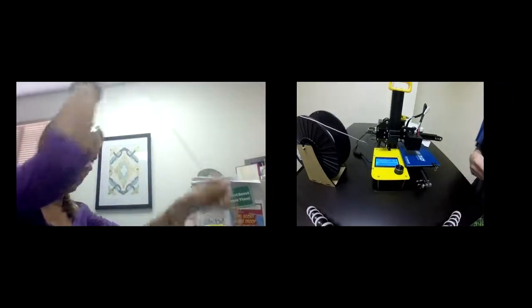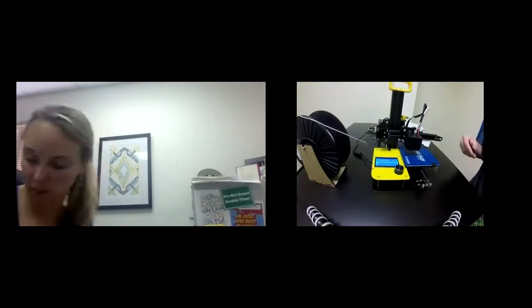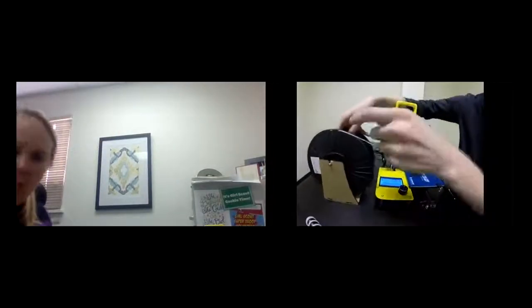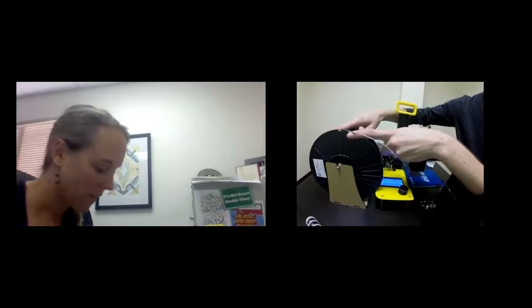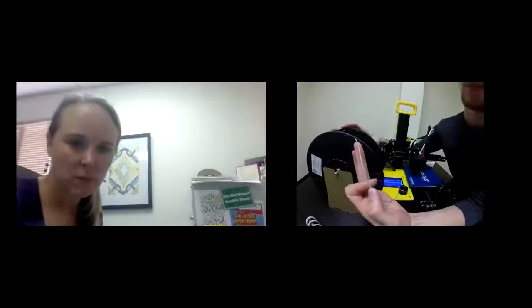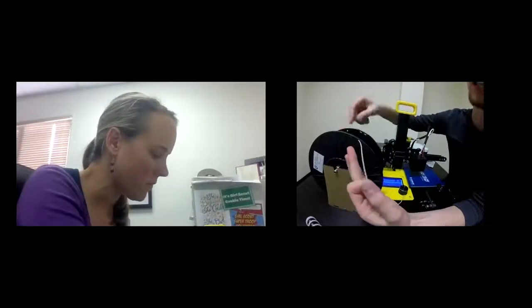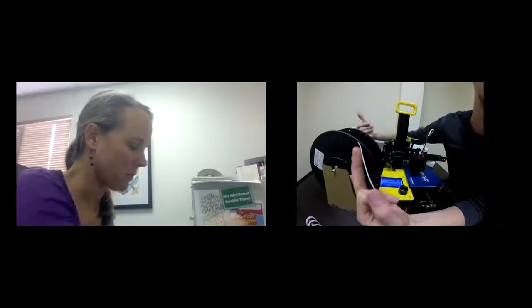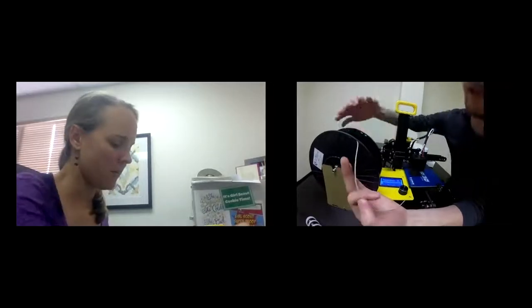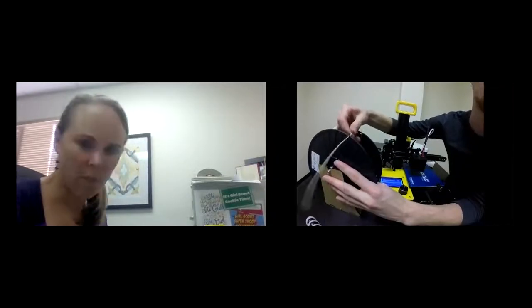You can unwrap your plastic if you haven't already. You'll notice the filament is poking through one of the sides — this is the best way to store filament. If you don't put it through one of the sides, it'll unspool and get tangled, causing a knot when it's trying to print and causing the print to fail. So preferably store it like that. Pull it out of the hole it's in and let it hang freely so we can put it in the printer.